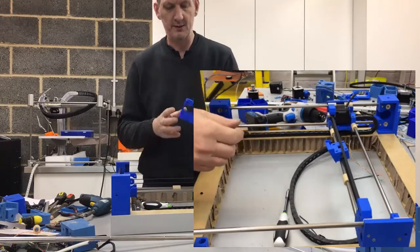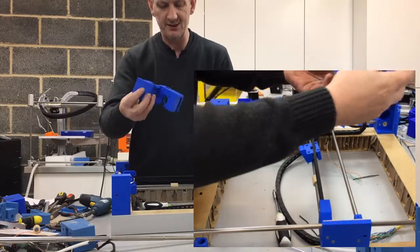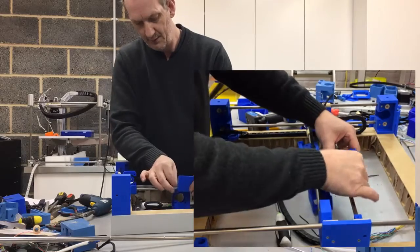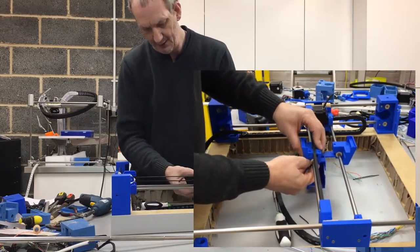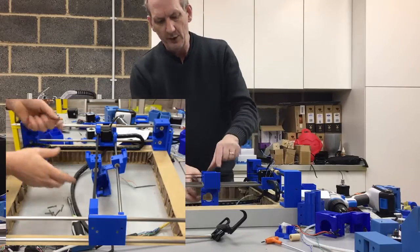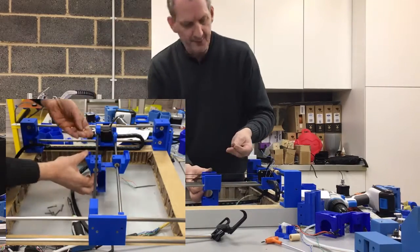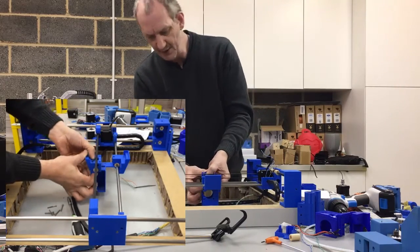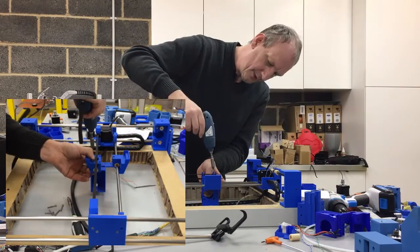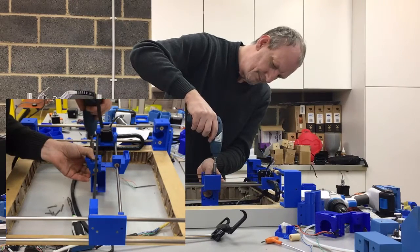What I'm going to do now is actually put on the print head itself. Slide that into position and bring that into line. For that you're going to want two of the 30mm bolts and two of the 25mm ones — the 30mm ones go towards the back and the 25mm ones go towards the front. Put that in and screw that in.